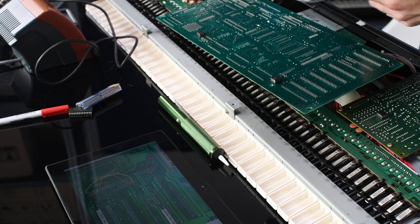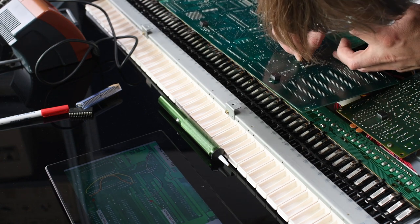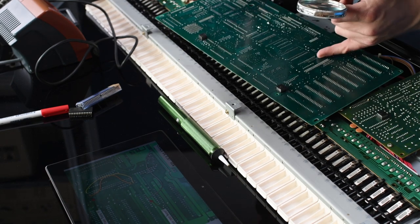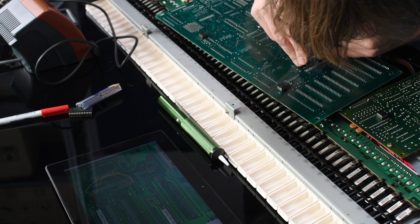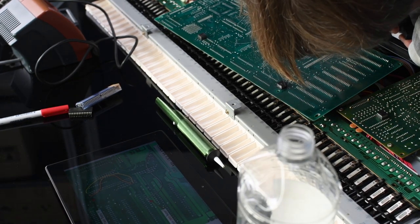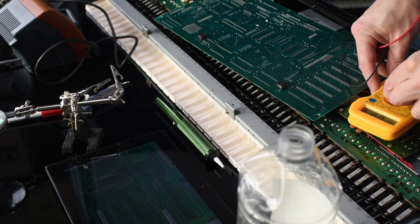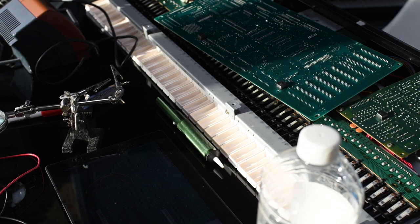Scary. The traces are pretty tough — good thick quality. Okay, there's one way to find out: check the resistance. I'm not sure you can get infinite resistance because there are always some capacitors around that connect some internals. I think 80 kilo-ohm is more than enough.